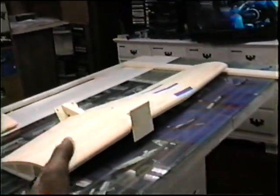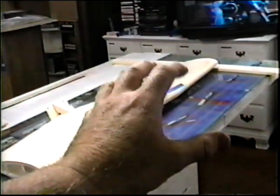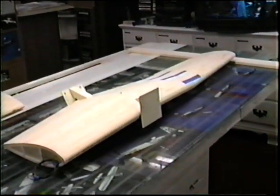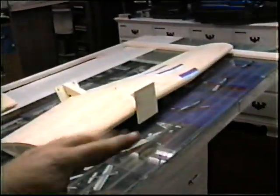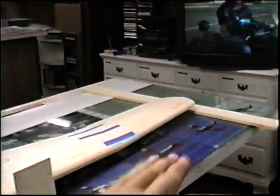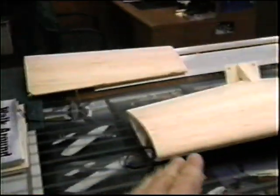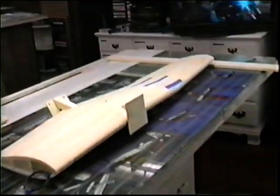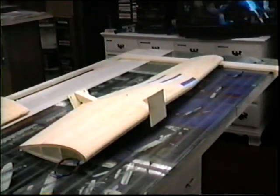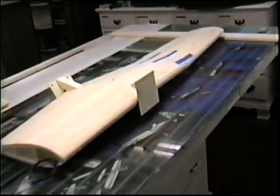to join. Now what I'm going to do is join one panel, let that totally dry, then do the other panel. Again, I can use a shim on the one side and use these two sides as flat. So the idea being when I do the other side, if I use the same shim, well, then you would think I have a good chance of getting the V because this is a polyhedral angle. It just makes something that's relatively difficult put some constants in it. And most important of all is to keep the center lines in the front.